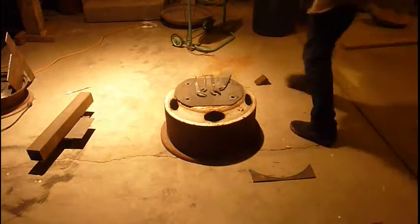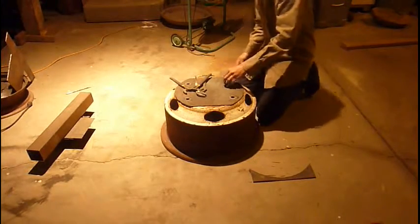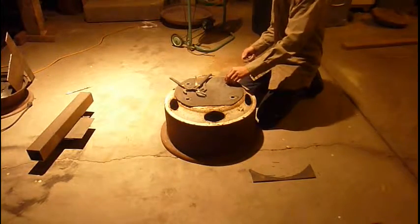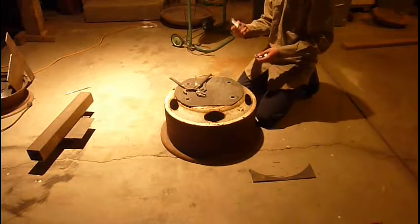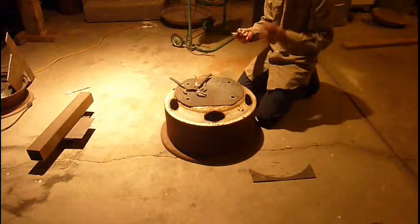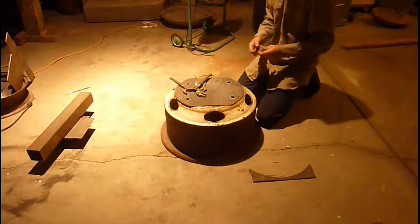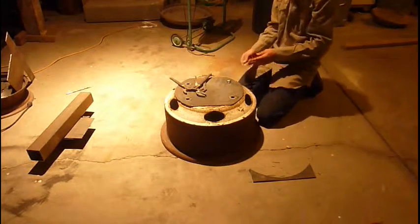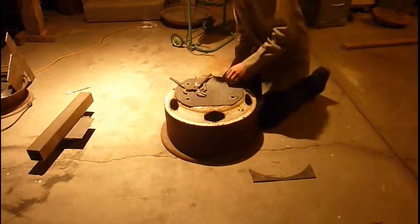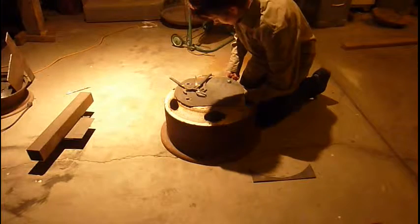Alright, so first things first, set everything else aside, and we're just going to start bolting on the base plate. So first, I did 5/8 bolts, a 5/8 lock washer, a 5/8 washer, and then a nylon nut for them. I'm going to put the lock washer on top because these holes on the semi-rim are really big, so I'm putting the big washer on the bottom. Hopefully I can just reach through here.